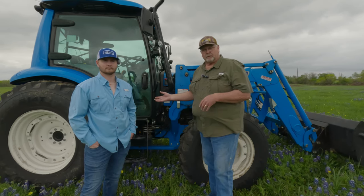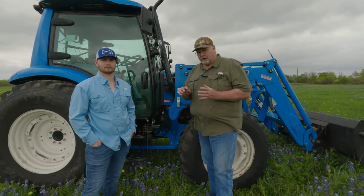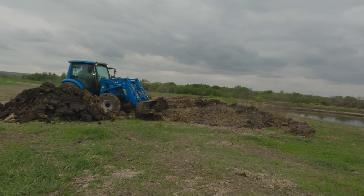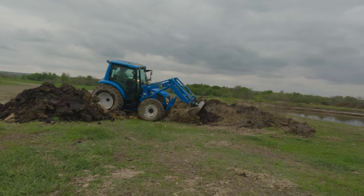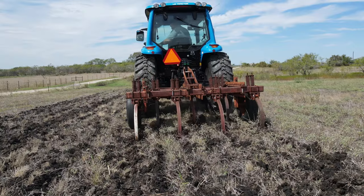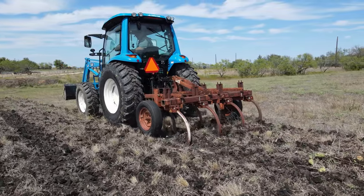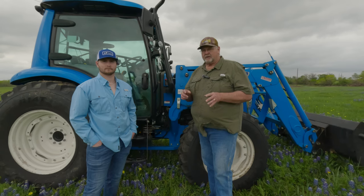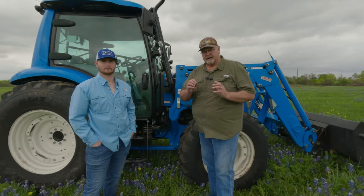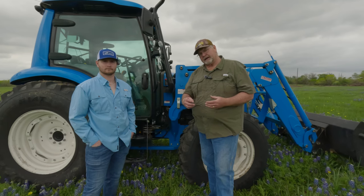There have been some comments about the R14 tires. I think people are looking at tractors trying to decide between R1s, R4s, or R14s. The R14 tires have done everything I've asked them to do. They push through the mud pretty well, they've pulled well even under circumstances where I've put the ripper and three subsoiler blades behind it. They've got pretty good traction. Now I do have a complaint about one of the Goodyear tires — but that's not an LS issue, it's a Goodyear tire issue, and we'll hopefully cover that in another video.